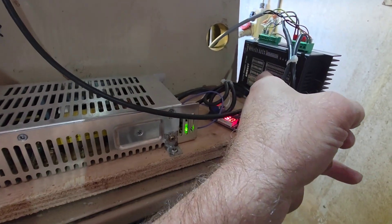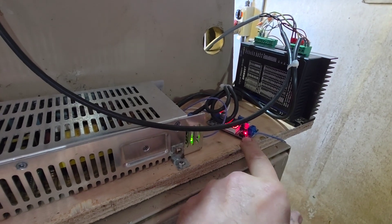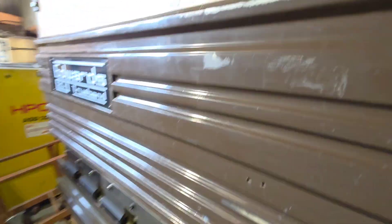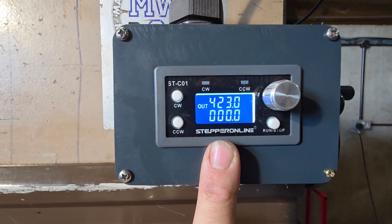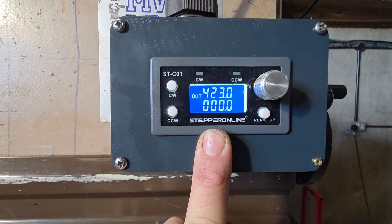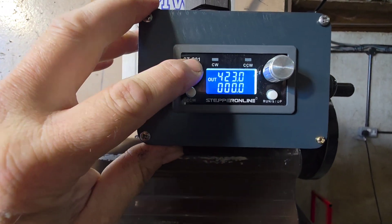So that gets me to this. We had the stepper motor, closed loop. This is a standard open loop, plain stepper motor driver. However, I'm not using the closed loop facilities on the motor yet. Put that on, put a power supply on it — five volts, I'll explain in a bit. And we used one of these. I've always thought what a great idea it would be if you could get one — well, guess what, you can. This moves the backstop.